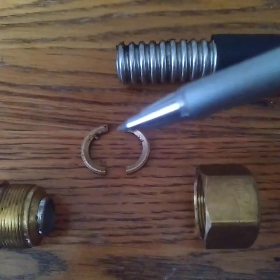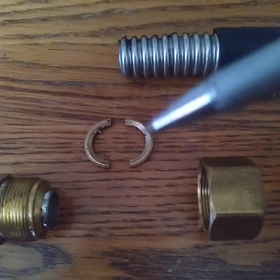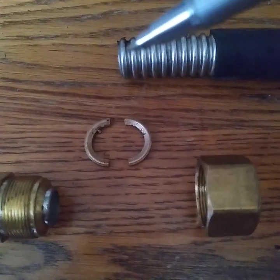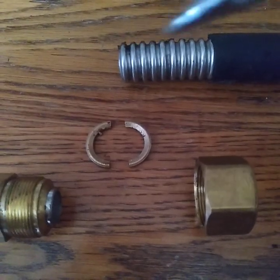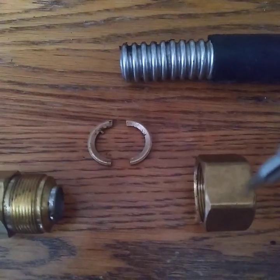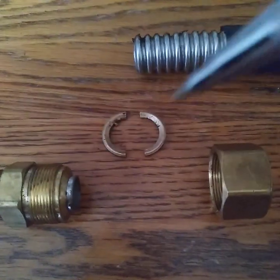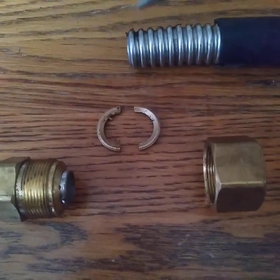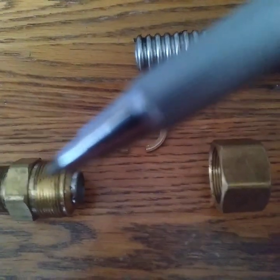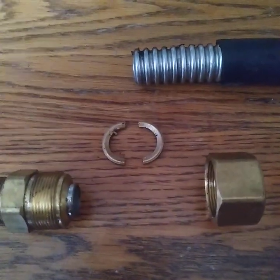This ring separates into two parts. Keep in mind now, other manufacturers may do it differently, but for this particular name brand, one puts half of this ring here, half of this ring here, pulls this nut up, and it will hold this ring if one holds it properly in the back here. And then be sure that both of these are on and it does not fall out. It'll go in this groove here. Then begin to progressively tighten this nut up on this thread, and that's simply how it's done.